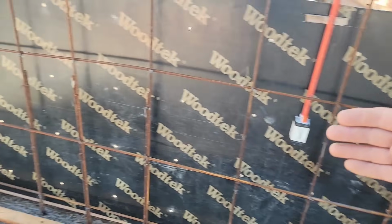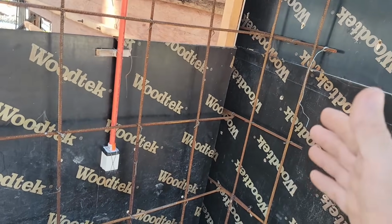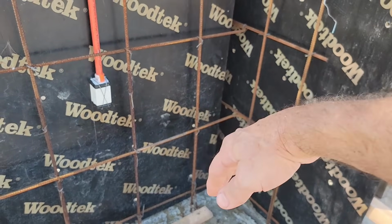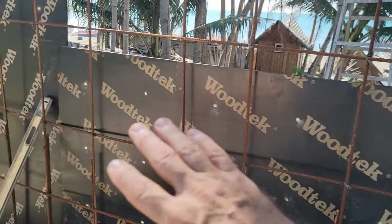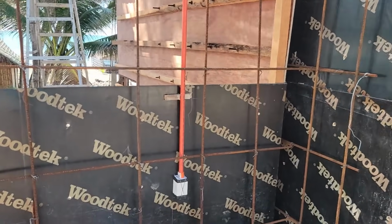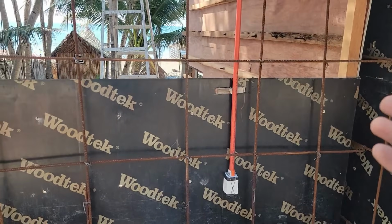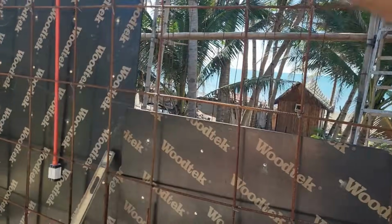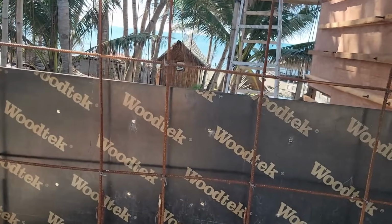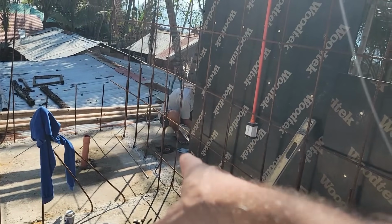So that's going to be one megalithic pour right there, very strong, because now you got two 90s going right there, and you got a solid cast wall. This whole wall is load bearing. Everything in here is load bearing, and everything works like a beam. It didn't need to be a beam when it's cast like this, because virtually the whole wall is like a gigantic beam, going from this span right here all the way back to this span back here.